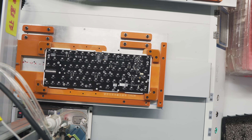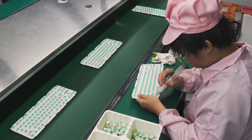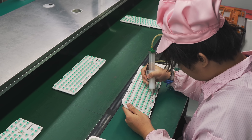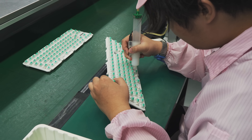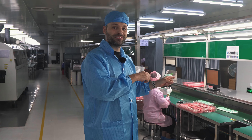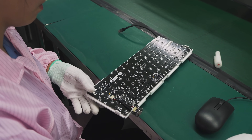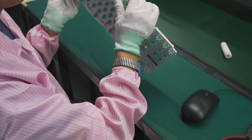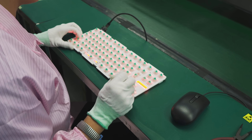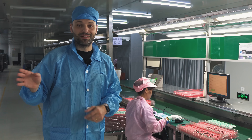After assembly, there's an extra lubrication step for the stabilizers — a syringe using air pressure injects the right amount of lubricant into every stabilizer spot, which helps prevent stabilizer rattle. With lubrication done, we move to the final phase of module assembly: a functional check. Operators check the RGB lighting — red, green, and blue — and verify every key switch functions correctly. This is also where the daughter board is assembled into the main board, and everything is boxed up for the next phase: case assembly.